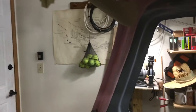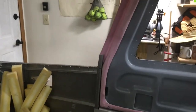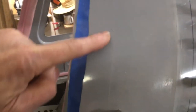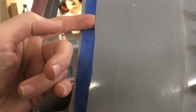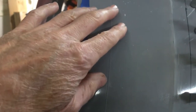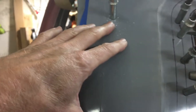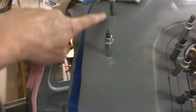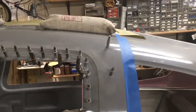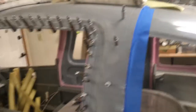I've got a couple of big clamps I tried. You would clamp along that door jamb or post — or whatever you call that thing — to try to pull the sides together. You've got the outer shell here and the inner shell that you can't see. You're trying to pinch those together and make sure this gets bonded together real well. So I added a couple of extra holes and put clecos in there. I'm not sure what the big problem would be — if anybody has tried it or has opinions, let me know.